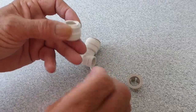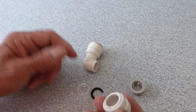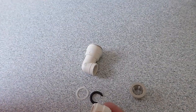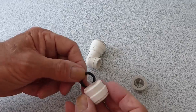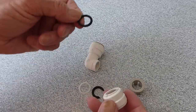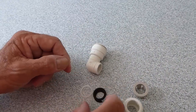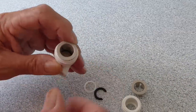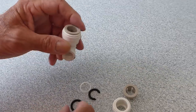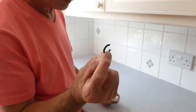Basically, if you've got one of these leaking, there's not a lot you can do. You can try to get an o-ring, but it is very difficult to get it mounted back inside. So at the end of the day, chuck it away. That's what the ring should look like, as you can see there. The other end is fine. Just a word of warning: if you do get a speed fit fitting that has gone and is leaking, it really isn't worth trying to get another ring back in there.